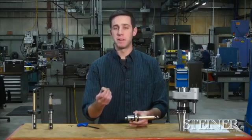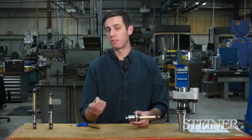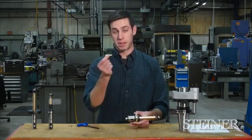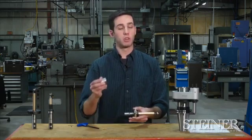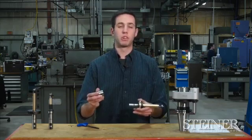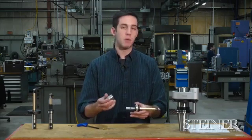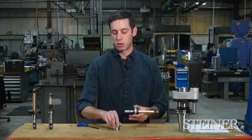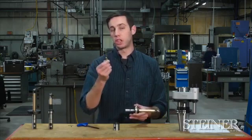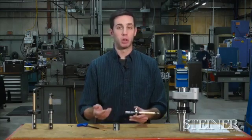And again, this shear pin is there so that if this blade does not close for whatever reason, this pin is going to shear, your shank is going to stay in your torque bar driver while your tool is going to stay in your part. This is a great system because now we are not damaging our tool, we are not damaging your part, and with the quick replacement of the shear pin, we can have the tool back up and running for minimal cost to you.